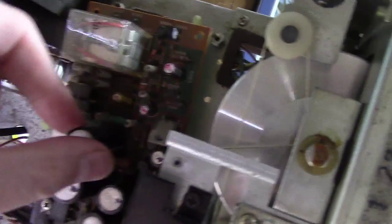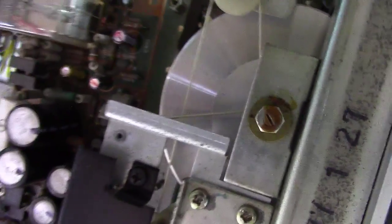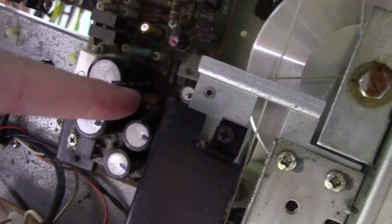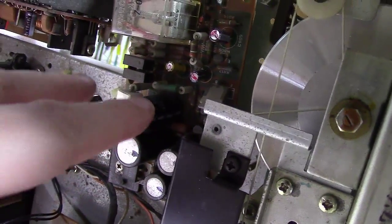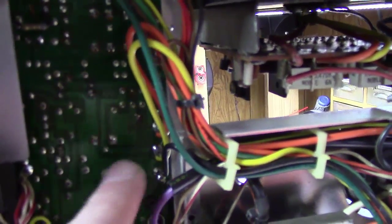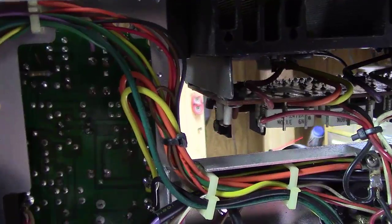If you'll notice where I'm grabbing them on the top, so I'll come along and I'll select one, like I'm going to get this one next. And I'll just grab it tight, get to the other sides, find the solder leads. One thing that'll help you refine the solder leads is look, you see the stripe on this one right here. Not the stripe I put, but the negative stripe, which tells you that the two pins are going in this way. And then if you come around to this, you just get in the general vicinity of where that thing was at, and you look for two pins going in perfectly in parallel there, and here they are. It's those two right here.